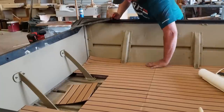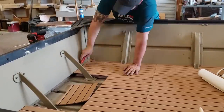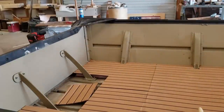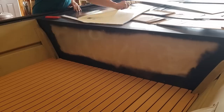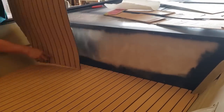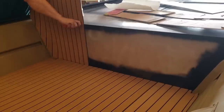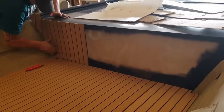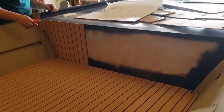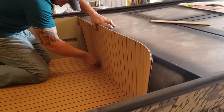Make sure you've got it exactly where you want it before you start pushing down. For final pressure, you'd ideally use a carpet or vinyl roller, but in my redneck brilliance I used a rolling pin — works just as well. Right tool for the right job, but a rolling pin will do. Make 100% sure your turf is placed correctly before applying pressure, because once this stuff is down, it is like Pierce Brosnan — it is bonded, James bonded — and it is not coming back up easily.